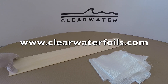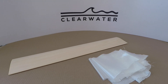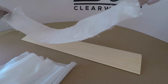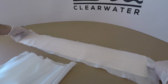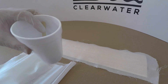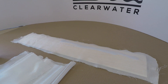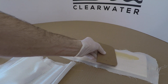We're going to start with the mast — it's probably the easiest part, mostly because it's fairly flat. We're going to start adding glass to one side. We have some epoxy mixed up and we're starting with the first layer, very simple and easy. Place it down evenly, pour some epoxy over, spread it out, and saturate the cloth.